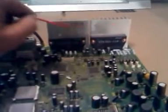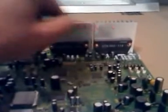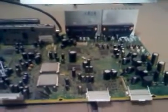We're just going to rotate this board around, and what you're looking for here are convergence amplifiers — and here they are. They're located on heat sinks, and these heat sinks are usually easy to pick off. In a lot of cases they're located on the deflection board, what's called a deflection board or high voltage board, but in this case it's on the signal board.